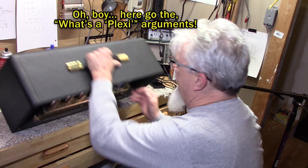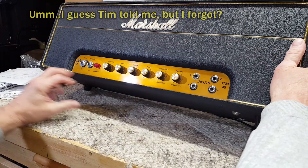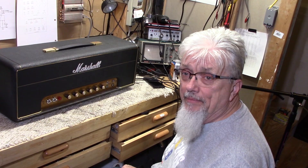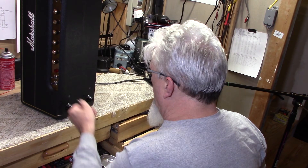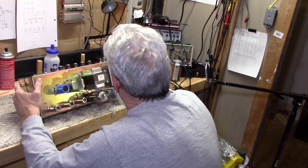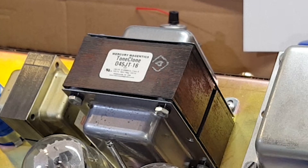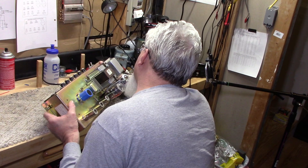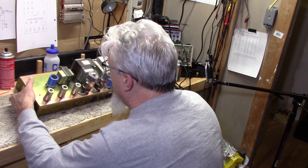We're going to see the front of it. I forgot to ask the gentleman who owns this who actually made this amp. It's got the Mark II on the front, a little mottling behind the coating, the two channels — the high treble and the normal channel. It has a Mercury Magnetics Tone Clone 16 ohm 045 JT output transformer, nice iron. And it has an actual Drake power transformer dated from June of 1989, so that appears to be about how old it is.